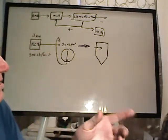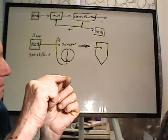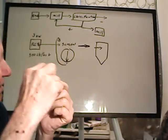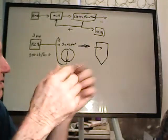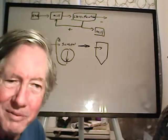On my crucibles, because you tend to get a little drip right at the edge, before I reuse them, I like to get rid of that drip. I'll grind it off so it doesn't run down the side of the crucible and cause problems.